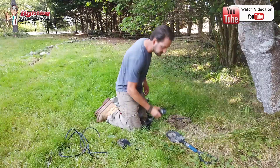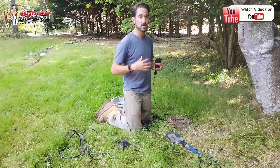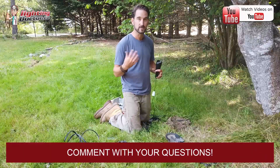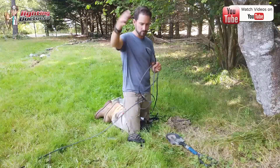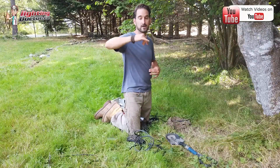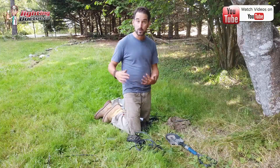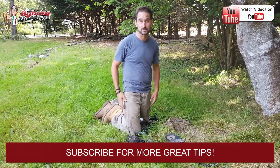Here we are on our project at Svald Springs. The first thing I've done, like I always say, is laid out all my lights to make sure I have the appropriate amount, and from there I calculate how many watts I need and make sure I've got my proper transformer size. Although I've already done those calculations first, it's always a good idea to double check. I've also laid out all my wire on the ground running from my last light all the way over to my next light — that way I know how much wire I need and my running path. We've got about 350 feet of cable going out on this huge acreage — about seven acres.